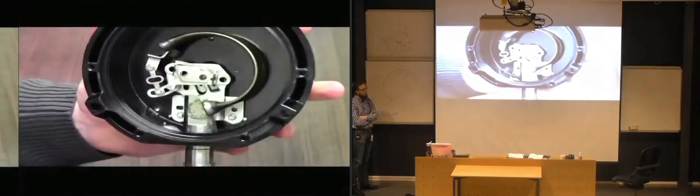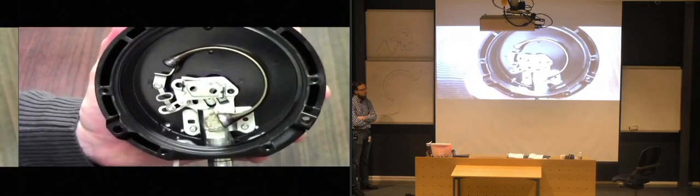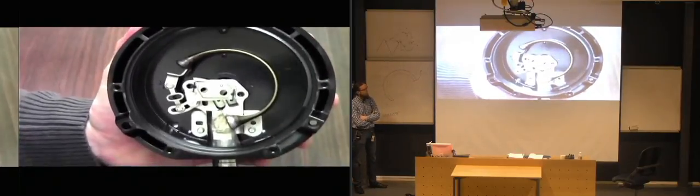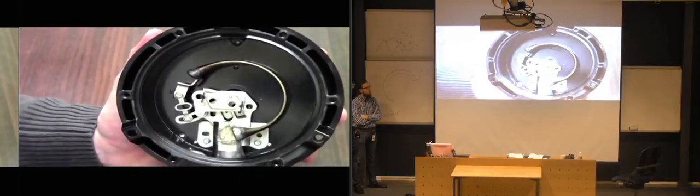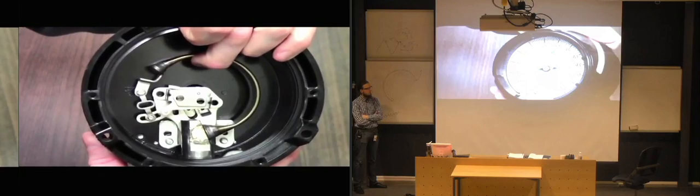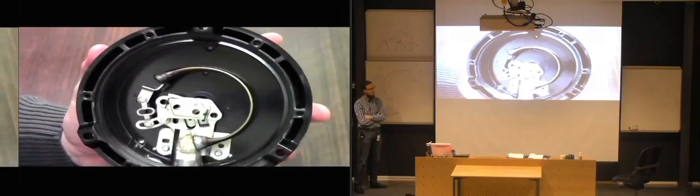Now, when picking a pressure gauge, it's important to know what your application is. There are obviously a lot of pieces on the inside of the gauge, which can be susceptible to vibration or pulsation in the line. So it's important to use liquid filling or snubbers or pulsation dampening movements on the inside, because on a vibrating application, you get a lot of back and forth movement, which is grinding the gears and moving the needle frequently back and forth. This ultimately will damage the gauge over time a lot quicker than normal usage.